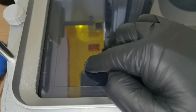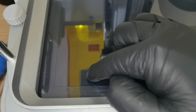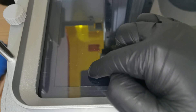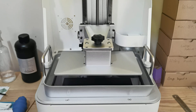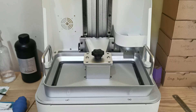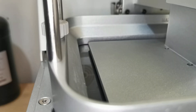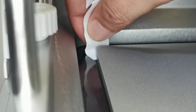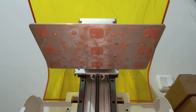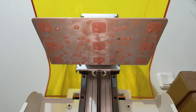The gap was more than 0.3mm. I checked leveling and set the Z offset using my usual 3 pieces of paper. Normally the gap on a printer is only around 0.1 to 0.2mm — some don't have a gap at all. This meant I was starting my print below zero height, which is why I had the adhesion issue. So I reset the Z offset with the resin tank in place, and estimated the plate height from the film using a single piece of paper so it wouldn't press the film down too much. The result: my leveling tester now sticks very well with only a 10-second bottom exposure.